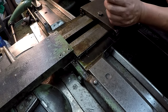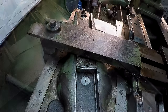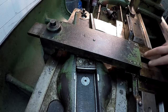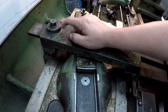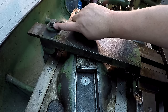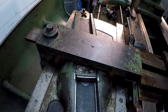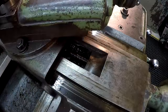The other question is: if this screw is moving with the cross slide, what's it doing over here on the handle end? I'll bring you around to show you. Here's the block, here's the plate that's sliding through here going all the way through there, and this is a clamp bolt - whenever you're not using the taper attachment you actually tighten this to keep that from moving. It's loose right now and it's really been worked on over the years - it really needs a new one.